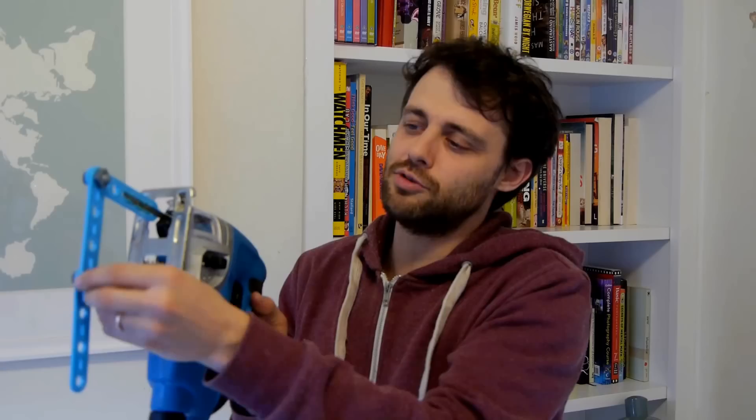I didn't screw them all the way to make them tight; there's still some give in there. I then sealed that off using Araldite so these things can't get any tighter or any looser — that's exactly how I want it. I then took the saw bit of the jigsaw and heated it with a blowtorch in a stand, and it was hot enough so that when I pressed the Meccano piece to it, it melted into it. That's how that final seal was made — and that is the inverted pendulum.